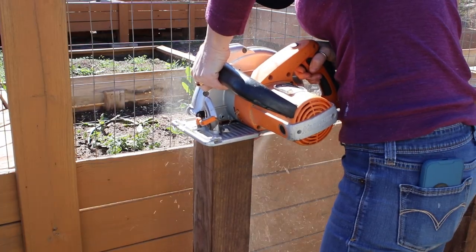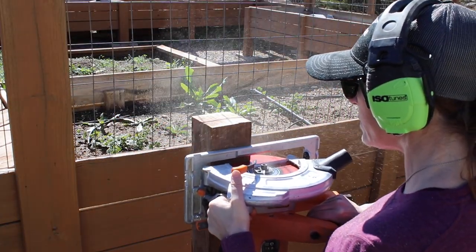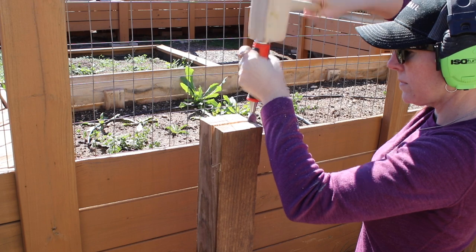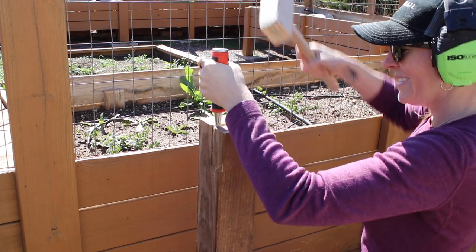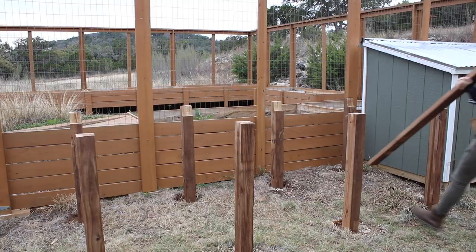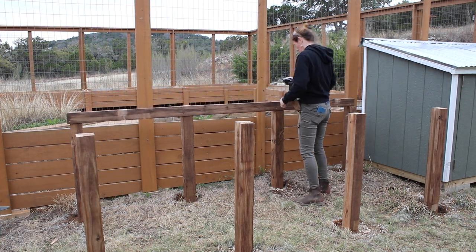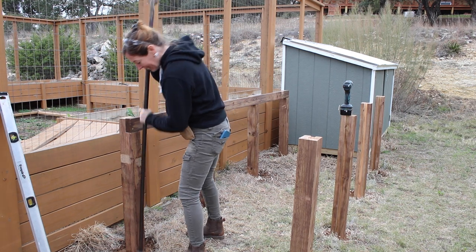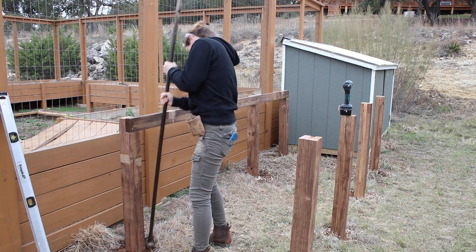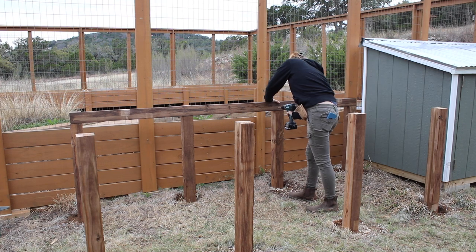While I was cutting I cut in a shoulder on all four of the back posts. Be watchful because if you move around a post as much as I did here you'll absolutely have to re-plumb it. A good tip is don't be too worried about perfectly plumb until you add a two-by-four that reaches across all four of the back posts to secure them together. At this point I made sure the posts were perfectly plumb and then tamped down and compacted the granite as much as I could. Take your time on setting these posts because if they're plumb and square then everything else from here will fly.